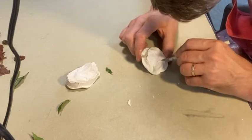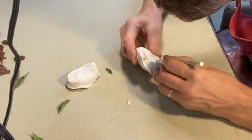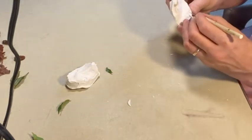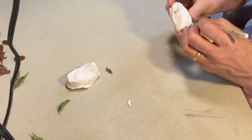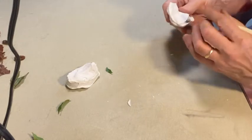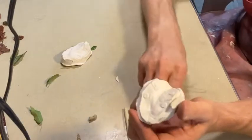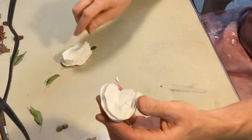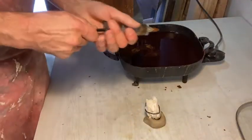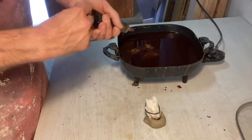Now it's going to leak, but the wax is going to cool off fairly quickly in these thin little lines. So the air will escape, and then the wax hopefully will flow into these a little bit and then just cool off. So it doesn't just continually flow out. Also, I don't want the wax to stick to the plaster. I don't want it to soak in. So I'm going to soak the plaster in water so that it's saturated in water. Then again, I'm going to use the syringe to give me a little bit of pressure. We'll see. Again, those pressurized pots.